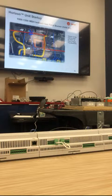So have you seen that pressure switch in the top right corner, where the flue gas comes out the pipe? That pressure switch is mounted on a bracket, and the way the bracket is bent, when they mount it in the unit, it's actually laying up against that flue vent, and it melts the switch. I mean, 2 or 3 of them like that. On this exact type? Yep.